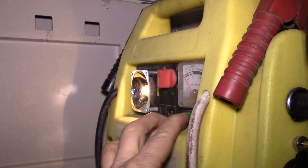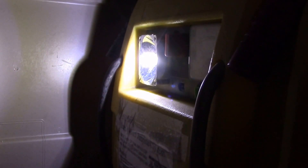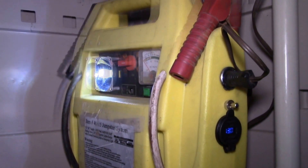Here's the original incandescent bulb — a pretty good focused beam because of the reflector. Now let's try the one-watt LED at about 70 milliamps. It's a quarter of the power of the original bulb but should throw out a lot more light. I think I'll go with that bulb. The cover plate sticks out just a little bit, so I'll have to see if the lens cover clears the bulb — that might decide which one I use.